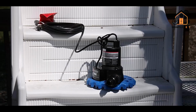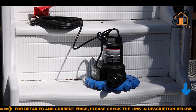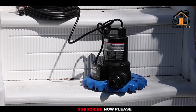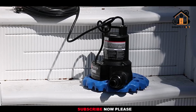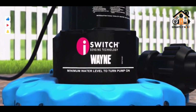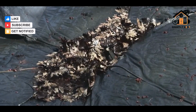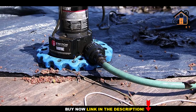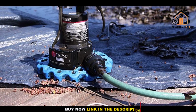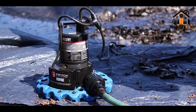One of its standout features is the integrated iSwitch technology, which activates the pump automatically when the water level reaches 2 1/8 inches and turns it off once the level falls below 3/4 of an inch. The pump's energy-efficient, oil-free motor provides high flow rates without excessive power consumption, contributing to both operational efficiency and cost savings. Additionally, the automatic freeze protection integrated into the iSwitch system safeguards the pump from cold weather damage, adding a layer of reliability during unpredictable winter conditions.